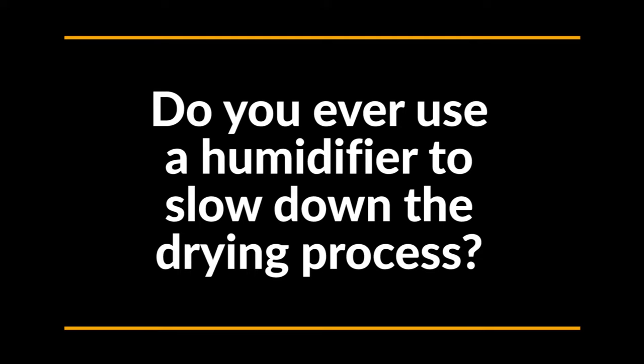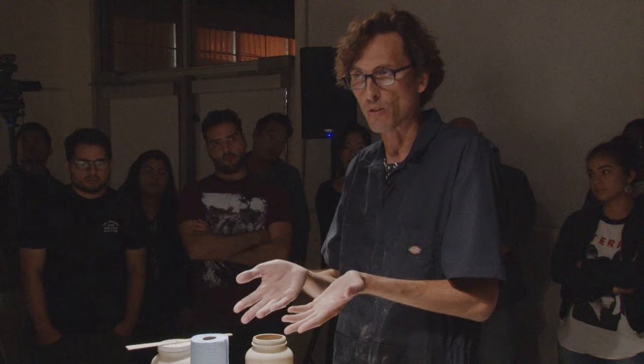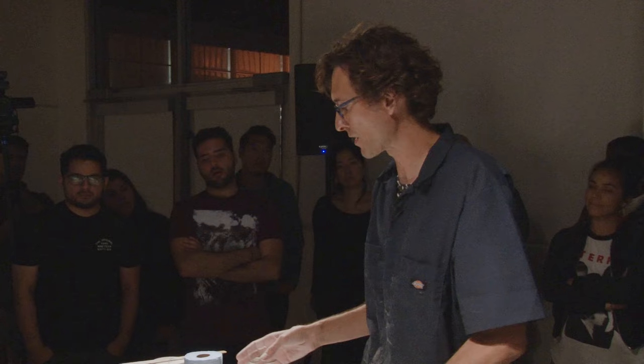All of that ends up being super traditional techniques in clay that, yes, I would use. What you always want to do, ideally, is let things dry as slow as possible. It's usually a big problem, like with the example I was giving, where you'd have something you threw on the wheel that was really thin in one place and really thick in another. You'd want to let that dry super slowly, right? The good thing about slip casting is, because it produces a thickness which is almost uniform everywhere, you don't really have to worry about that so much.